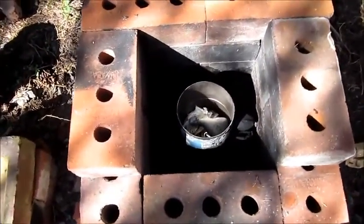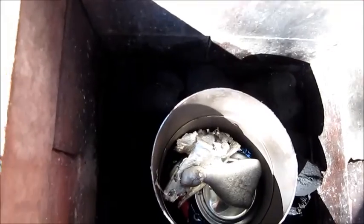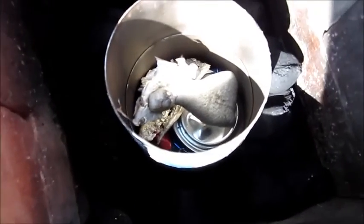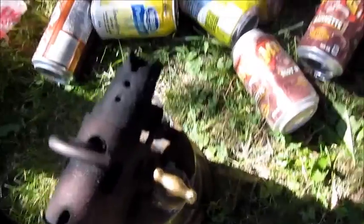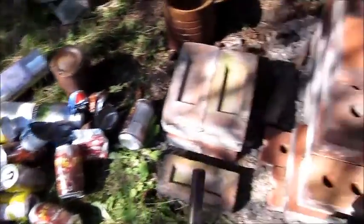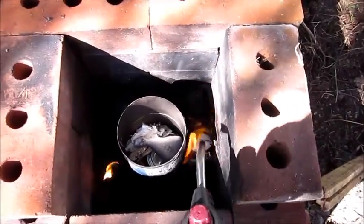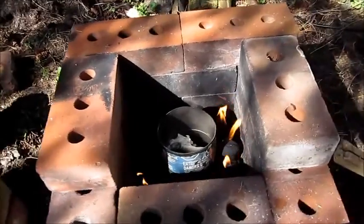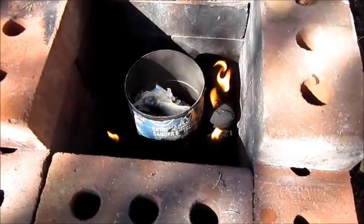I'll be back when I have it lit. Now what I've done is I've just put in some charcoal on the bottom and all around the crucible, and in it I have two crushed pop cans in the bottom with some scrap aluminum left over from the last melt. I took my torch and sprayed some kerosene all around it and lit it up. Next I'm just going to turn on the fans to low and let it heat up.